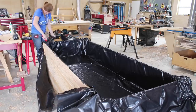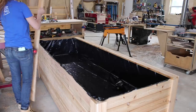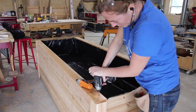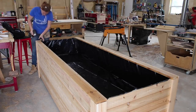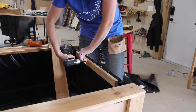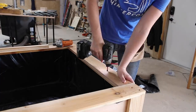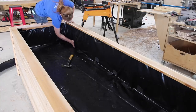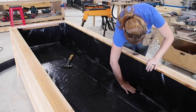Now to the top trim — these are also cut from cedar 1x4s and placed directly on top. I started by attaching the two longer sides and then the two shorter sides. When I went to place the short sides, I didn't like how much rocking there was, so I quickly added a scrap piece flush with the top slat to support it. I also went back and duct-taped over all of the bottom staples, since I'm adding drawers under it — better safe than sorry.